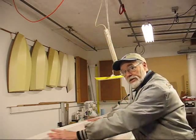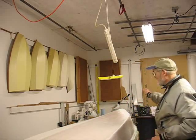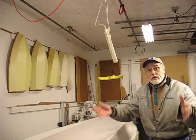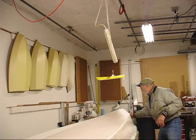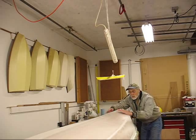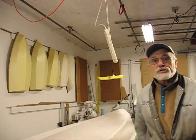Let me take a quick shot of the cutting I've done on the stern and then we'll end this. The next segment will be the wetting out. I had been starting in the middle and working towards the ends before, but on this hull, given how this glass has been treating me, I'm going to start up near the bow and work my way back evenly across the top — start at the bow, come out, work down to the edges, and just keep doing that center-forward-out pattern.